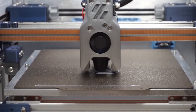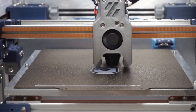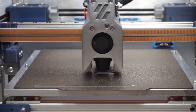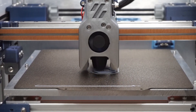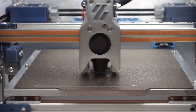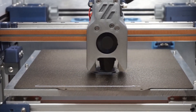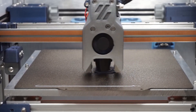This is obviously not ABS since I've got everything opened up — it's PLA, running at about 100 millimeters per second. The walls might be 90, but it prints really well at 100. I've actually got it tuned up to about 150 millimeters per second.